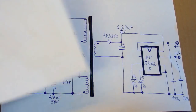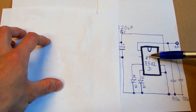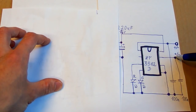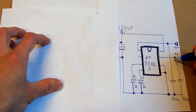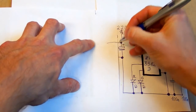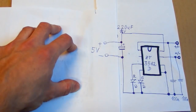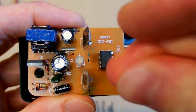So let's remove the power supply and keep just the charging circuitry. There is a clever charging chip with indicator LEDs and some capacitors. This is the output and it has an automatic polarity detection system — it will automatically detect the polarity of the battery and choose the right polarity. We will connect a USB power supply here, and let's make all the components of the dodgy power supply magically disappear.